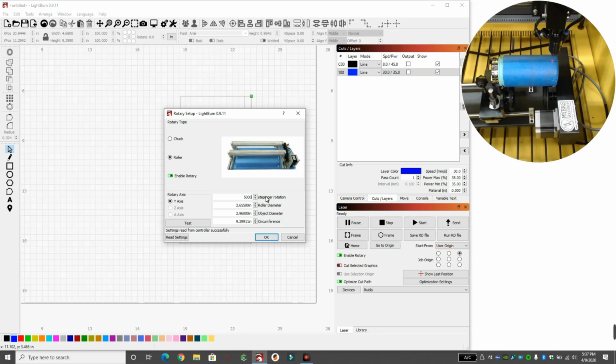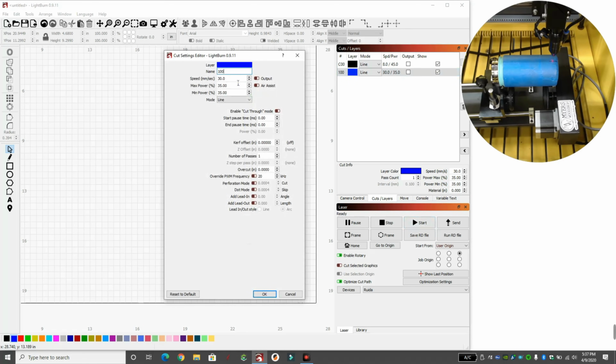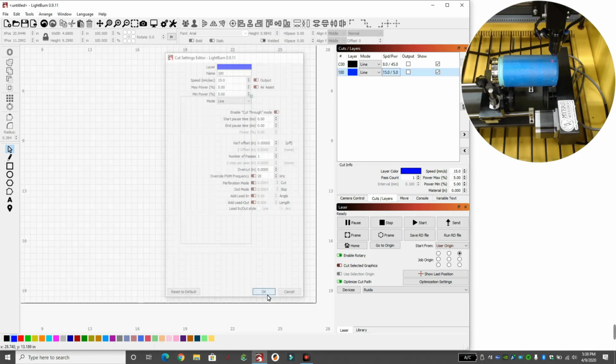So if I start at 5,000 for purposes of this video, we know that this number's right, we know that this number's right, we know that this number's right, because we put those in and measured them. We have no idea what this number is. So we're going to start at 5,000, and we'll hit start, after we change our speed and power. So I'm going to do this speed at about 15, and I'm going to do this power at about 10, because I don't want it to cut through the tape, because I just want it to engrave on this. I'm actually going to do this power maybe at 5. I'm not sure what my minimum power is, but I'm going to do it at 5 at a speed of 15. I'm going to hit OK.